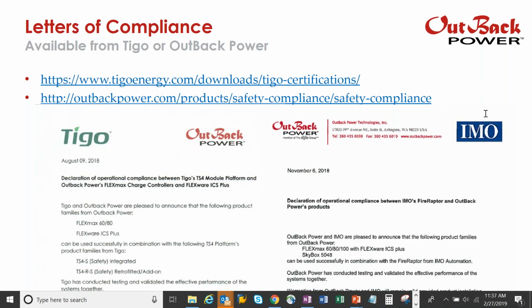Is there still a concern regarding the installation of an FM100 in parallel with an FM60 related to ground fault? Yeah, there are a couple issues with doing that. We do have a white paper about that. This is a question from John Harold. John, I'll go ahead and send you that white paper about how to combine FM60s, FM80s with FM100s in the same system. The trick there is the voltage difference in combination with the ground fault breaker for FM60s and FM80s. We generally wouldn't recommend combining FM60s and FM80s and FM100s in the same system. However, I will send you that white paper so you can judge for yourself how you would want to do that.